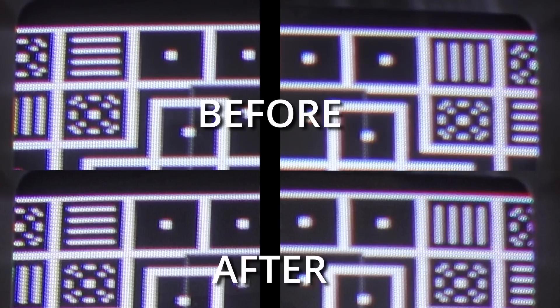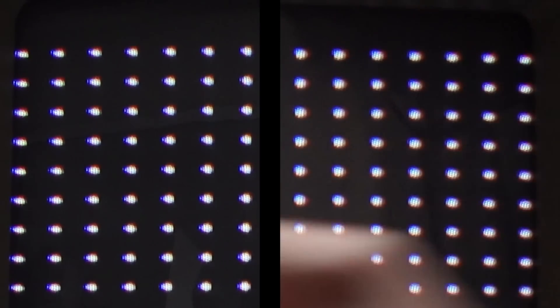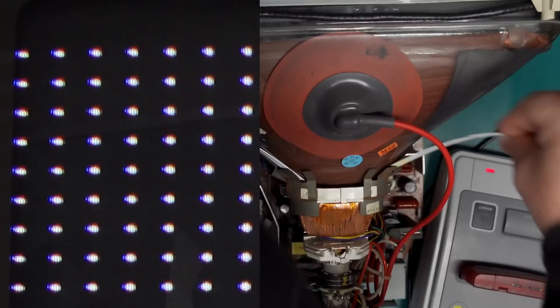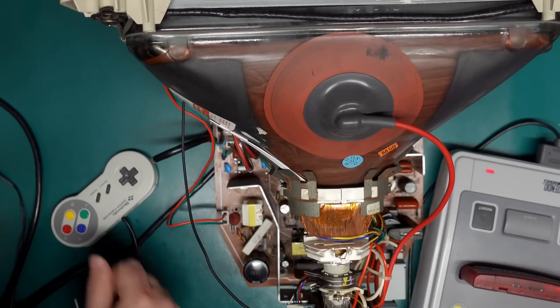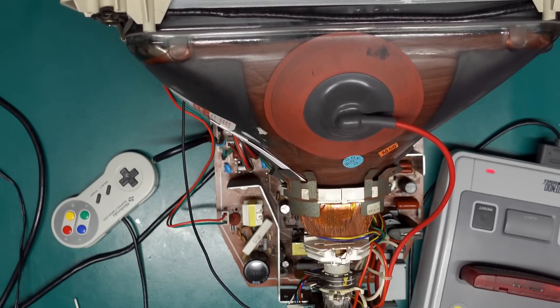It's not perfect but it's better than what it was and it hasn't messed up the other side. Here's our convergence pattern again — yeah, still not quite perfect, still a little bit messy in that corner. That's about as good as we're going to get. Adding another convergence strip just makes it even worse. I think if this wedge wasn't here I might be able to get it in a slightly better position, but I don't have a source for these type of wedges so I'm going to leave it in place.